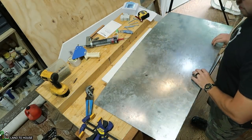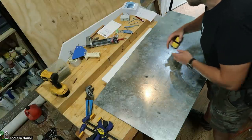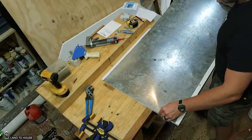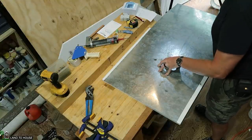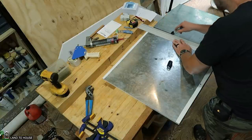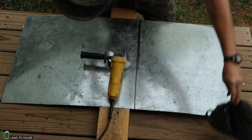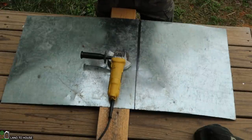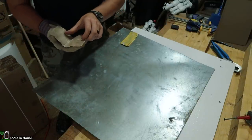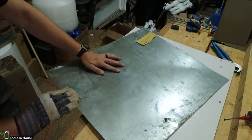I went ahead and got that small piece on the bottom of the plywood. Let's flip up our metal piece. This is about 22 and a quarter inches in one direction, and I want to hit the 25-inch piece in this direction. There will be a little space on the sides, but it's going to be no problem. I'll take a sharpie and mark these spots so I can cut this with the angle grinder. I'm using glasses, a mask, and earplugs just to make sure I don't get any metal in my face. And then I'm going to sand down the burrs on the edge.